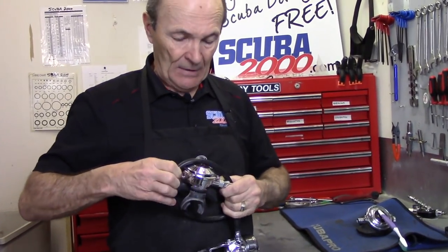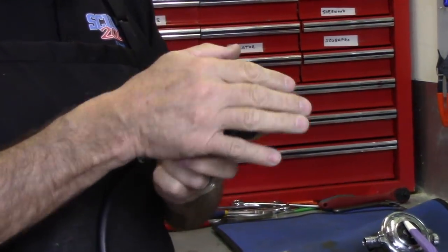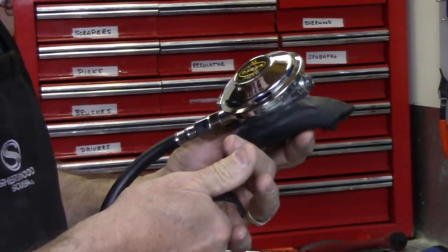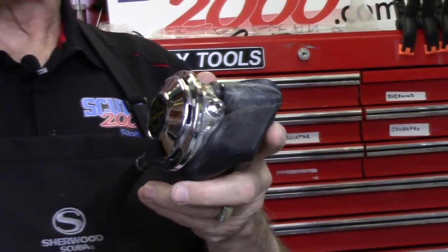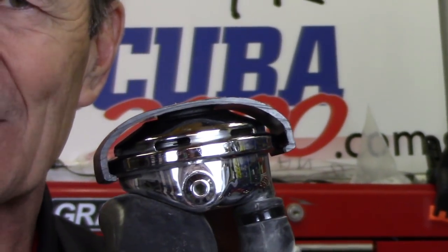Here's Dacor's system — this is pretty neat. Dacor is no longer with us, unfortunately, but was one of the biggest and most popular scuba companies ever in existence. This is one of their fine regulators, the Dacor 400 from many years ago — a beautiful regulator, all chrome. Their later models were plastic like ours today. They came with this clip right here, designed to go over their regulators. It says 'Remove for Diving — Purge Button Depressor.' They actually have a name for it: PBD — Purge Button Depressor. It was simple — just like the reader's idea, just a little more sophisticated. It very slightly pushes down on the purge button, taking the pressure off the spring and the seat. Later models of Dacor got rid of that clip because divers kept losing it.